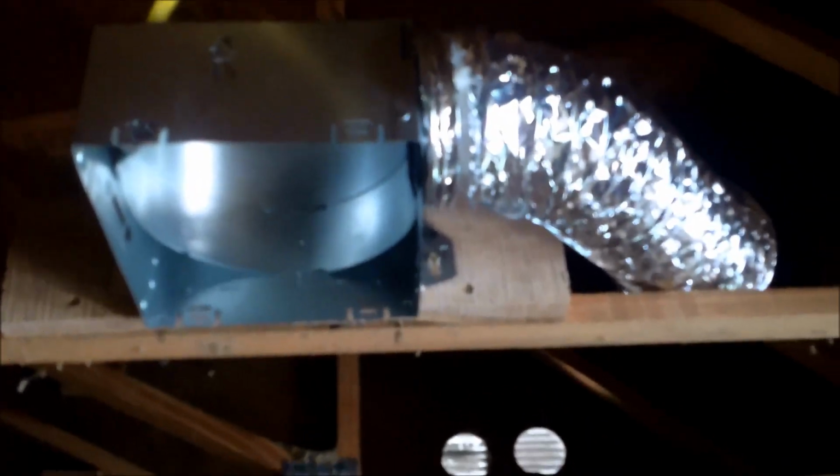Alright, the ductwork is installed, zip tied. Now the manufacturer recommends you only use zip ties in the instructions they included in the box. But I'm going to go around it with tape just to be sure, especially on that connection up there. Now down here it's real tight because it's a sponge type connection, and when you pull that tight, it kind of squeezes that piece of foam rubber you put around it for the 4-inch connector. And so that one's real tight, and there's not really much you can tape to.